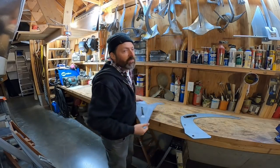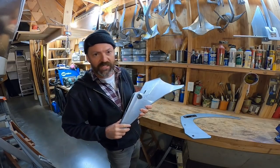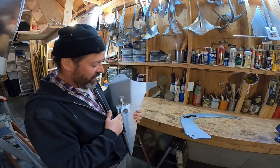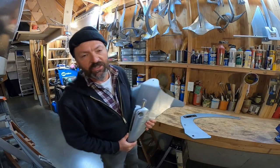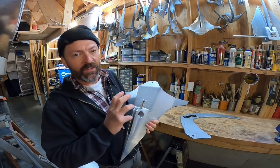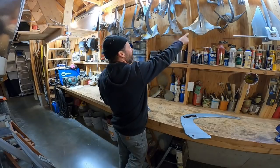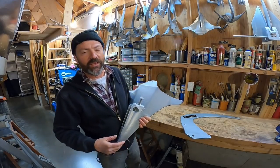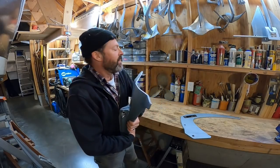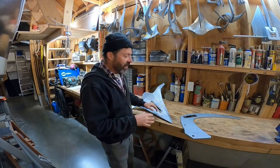The fluke is made from two pieces. Basically the forward half is cast, and you can see some roughness. I imagine this is a sand casting — a high volume item — so it's not very precise. Indeed, the slot that the shank fits into is not a particularly precise fit. Once you get the bolt in and snugged up, it does force the shank over to one side. On the smaller 17-pound Mantis M2 there was some wiggling in the up-and-down motion after tightening, but that's not the case with this one — it locks in quite firm.